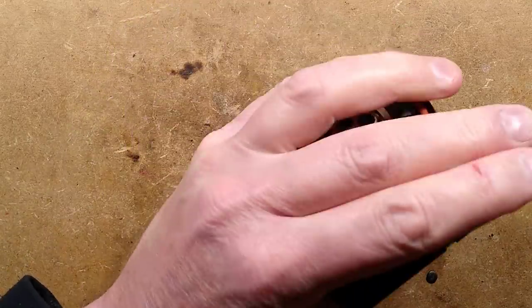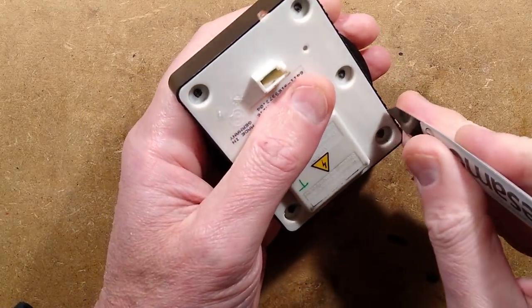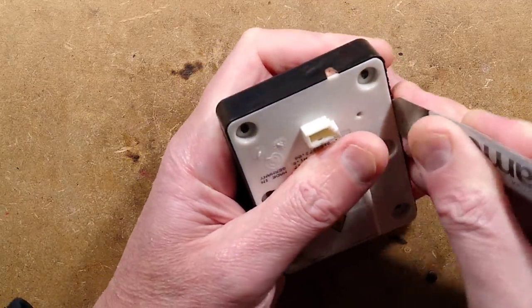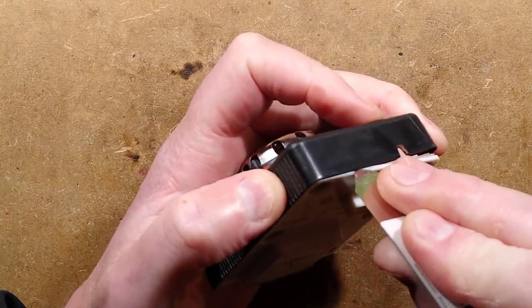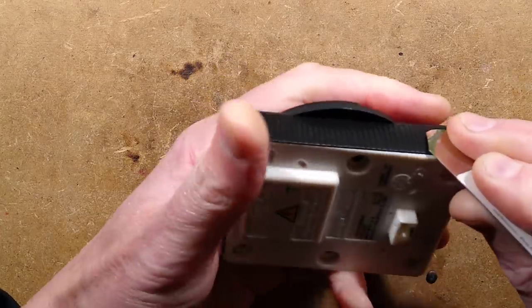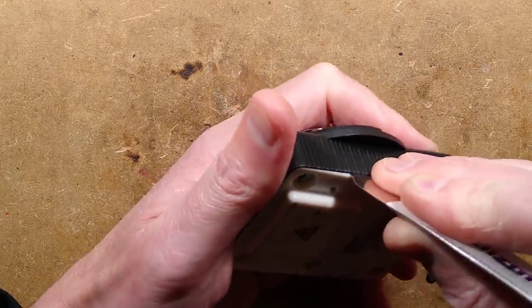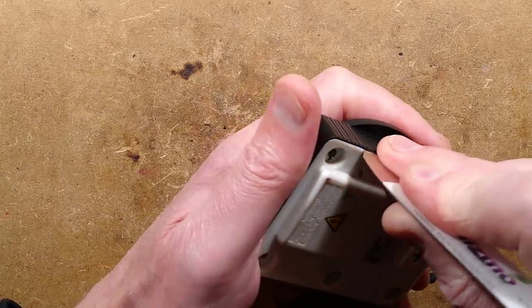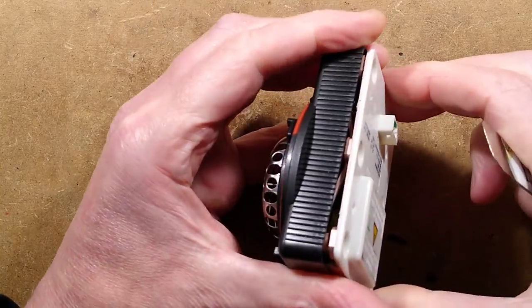The rivets are done. Let's bring the spudger in so I can open this in a controlled manner, having just completely obliterated all those rivets. There's an element of mystery — I'm not sure what the coppery thing at the bottom is. It's almost like it's got screening, which would make sense. Hopefully they haven't resined the circuit board in, with the PCB and little ceramic plates attached — that would be terminal.